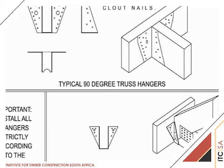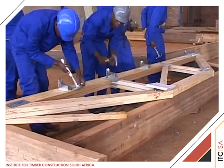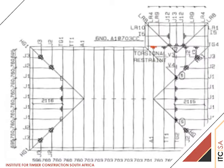Reference to hangers and cleats to be used in the following demonstration can be found on pages 13 and 14 of the volume 2 handbook. Our demonstrator has chosen to fit all the necessary fixing brackets for the main hip trusses onto the TG4 girder before erecting the TG4.